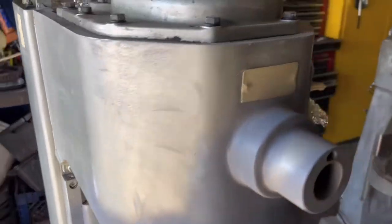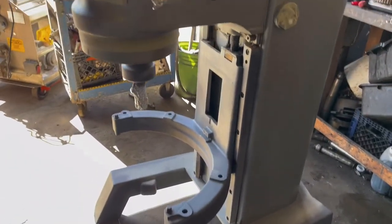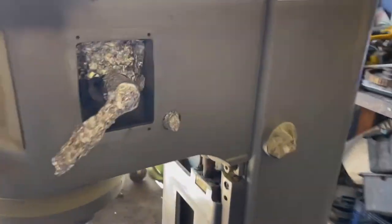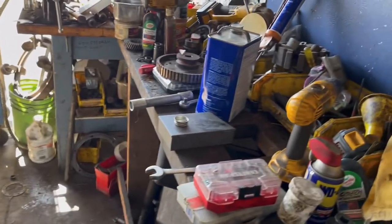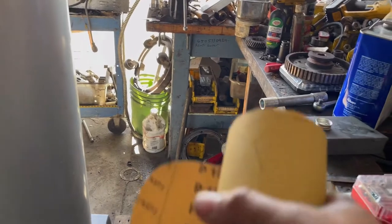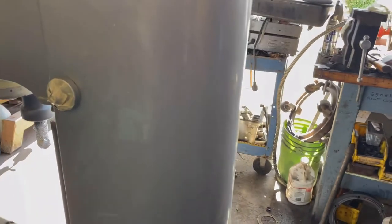Clean the surface with acetone to get rid of any excess oil. So clean it good. Again, dry sandpaper. I use 220. You can use finer sandpaper, but I was using 220. And for the rougher sections, like exposed metal, I was using 180. But on the areas that are good, you don't need to use rough sandpaper.